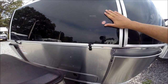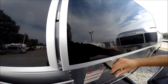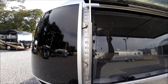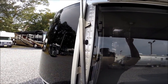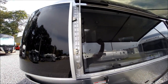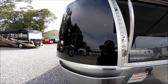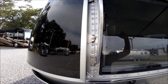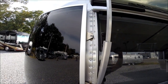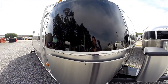You have solar stone guards up front. There are two tethers you can remove, and you can lift the rock guard up and tighten the thumb screw on each side to adjust the height, which allows you to open the window from behind. This curved solar stone guard is removable — you can clean the glass behind it by using a Phillips head screwdriver, turning a quarter turn to undo the rock guard, then swing it out and lift it off.